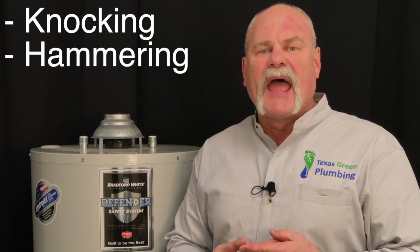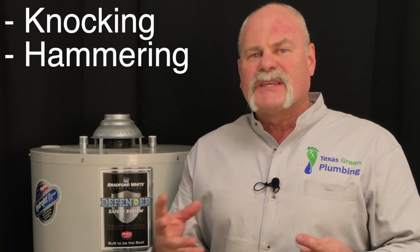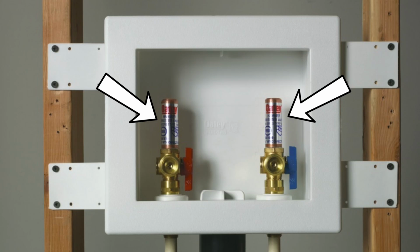All right, knocking and hammering, two more noises. Now this can be caused by a shock arrestor not being installed, or a water hammer arrestor. What happens is some fixtures, a toilet can do it, normally a dishwasher, something that has a solenoid valve where water is instantly on and instantly off, it can cause that water to hammer and pop inside your walls. If it's really bad enough, we have opened up walls and installed shock arrestors or water hammer arrestors.